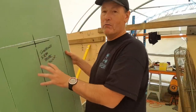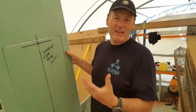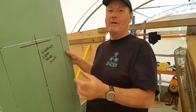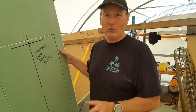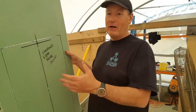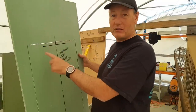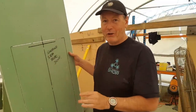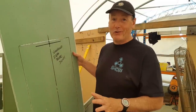And that would be my plan, to have good rigid, lightweight foam doors with a 1.6 millimeter thick Queensland walnut or something like that on the outside, so they get that wood look, but the benefits of foam core and weight, and I won't have any cardboard or hollow core door or nylon core or whatever, still foam, continuing the mode all the way through the boat. But for now, I'm going to put this back in place, and I'm going to trim these out and put these doors in a safe place up in the factory, so they're out of the way, so that when it comes time to do the doors, they're ready to go.